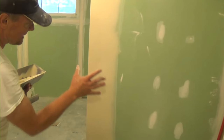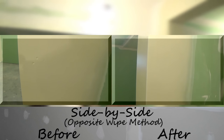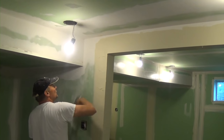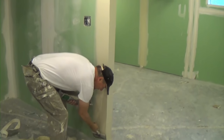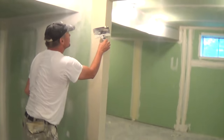Now, see the pox marks? That's because I had to add mud right away and it didn't sit long. Now I'm going to have these little pox marks in here. But that's okay — these are not major wounds. Since this is set now while I did all of that, I can wipe this out and they shouldn't be there. I shouldn't have an issue with them. And if you are, maybe thin your mud down a little bit more if you're still having problems.